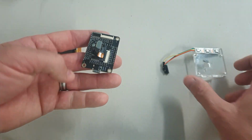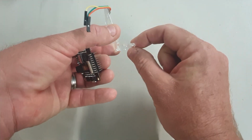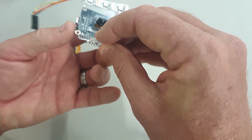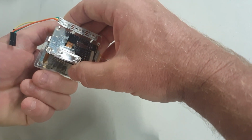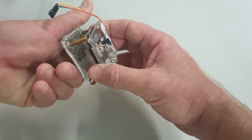And then the mounting bracket for the camera, I just laser cut out of acrylic, heated this up here and just bent it into the angle I want for the camera to sit. And this camera here will just go through the hole there. With a little blu tack, I just hold him down and I screw all 3 of them together like that. And then that front bit will just bolt onto the Maix block robot.